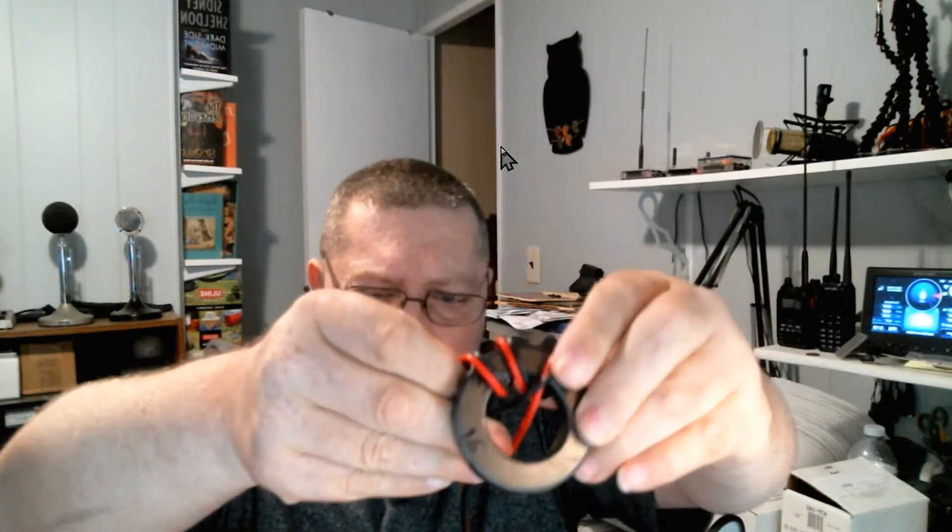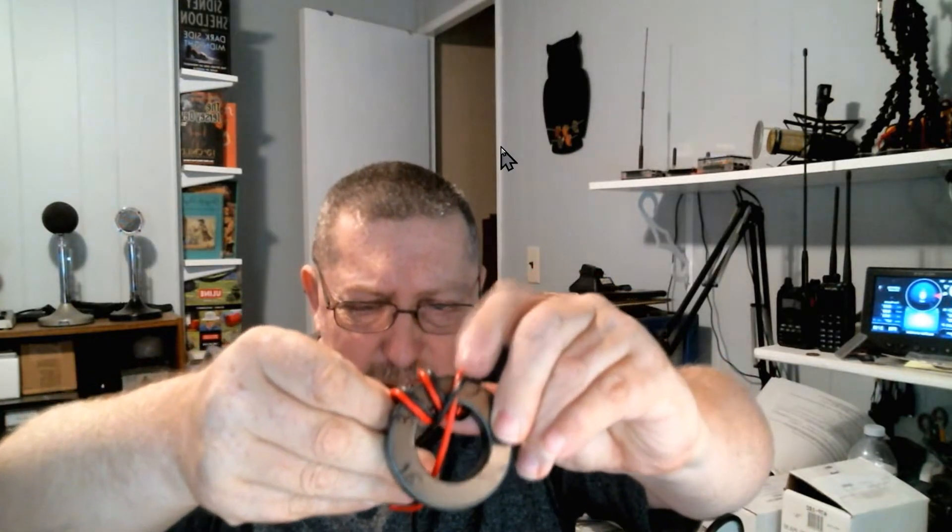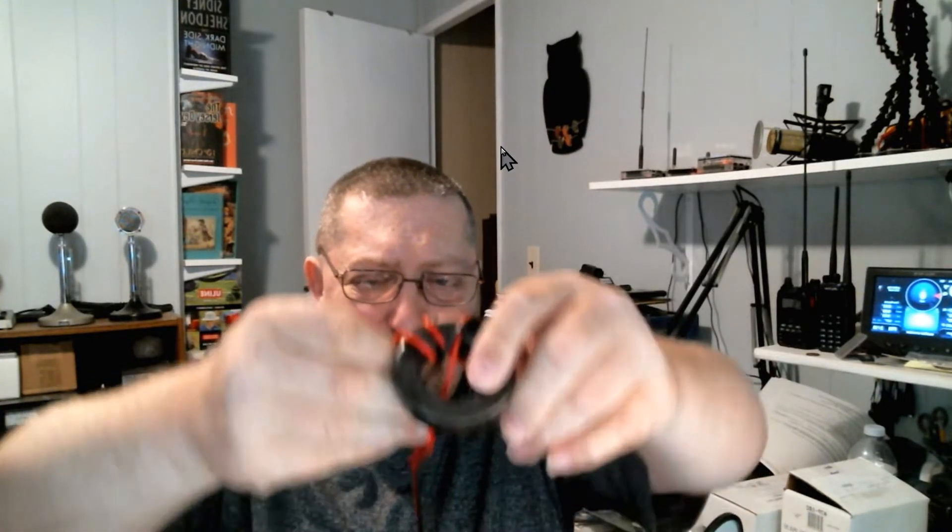With the power wire you can also use a toroid. You can see I went through it three times for demonstrative purposes — one, two, and three. You can go all the way around if you want, it just adds impedance. At around eight to ten turns you will reach a point of diminishing returns, so there's no sense going more than ten because you won't get anything out of it.